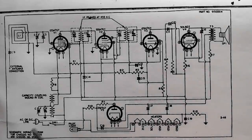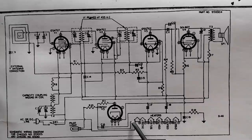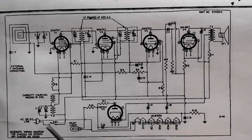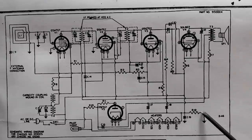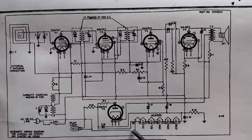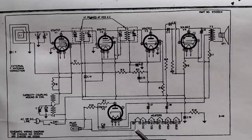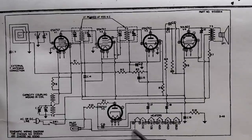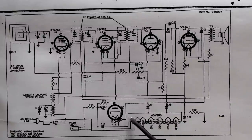I've managed to get a circuit diagram. The line comes in, goes through the filament in the rectifier, runs through a surge resistor and sits on the plate of the rectifier. The other line goes through the switch as the B-minus return path. The B-minus goes to the chassis through a capacitor and a resistor — that's the 0.02 we looked at before. All the other filaments are also on this path, meaning all the power this radio consumes goes through that one little bit of filament. If there's a high current draw or something fails, that filament is going to get overloaded. I just don't get why you'd put all that through one little filament, but obviously they do and there's a reason for it.